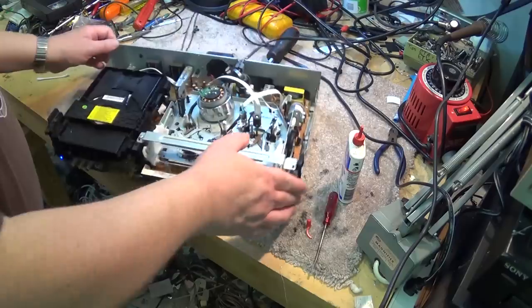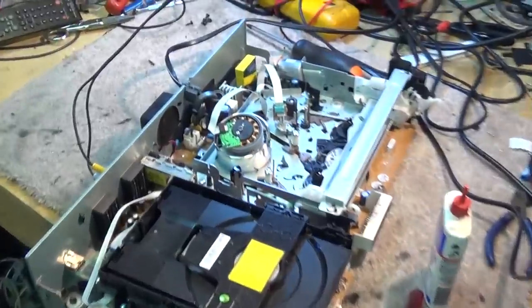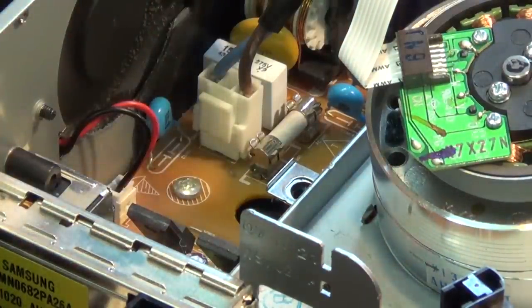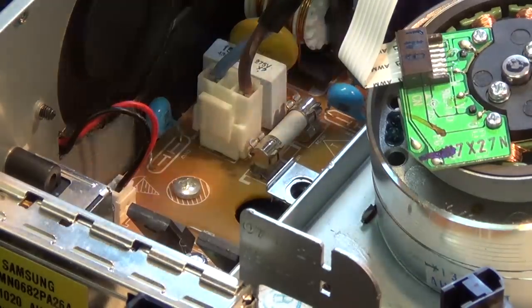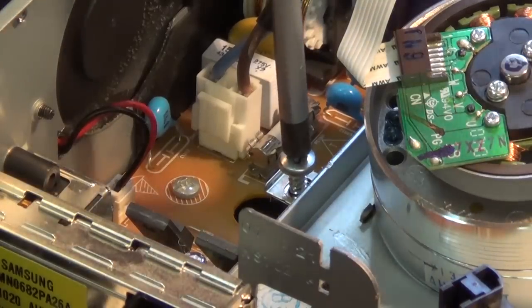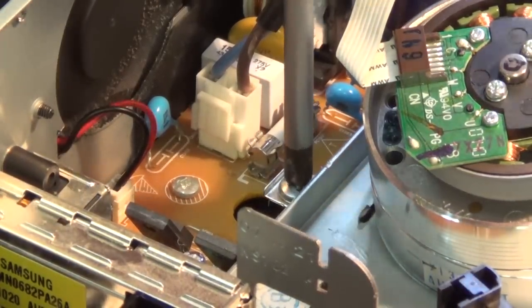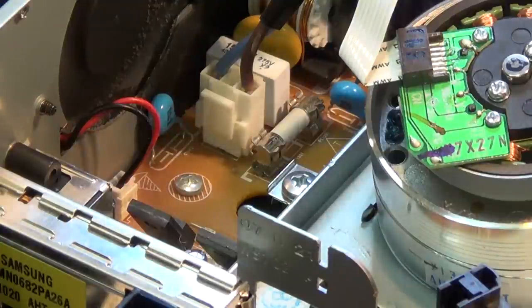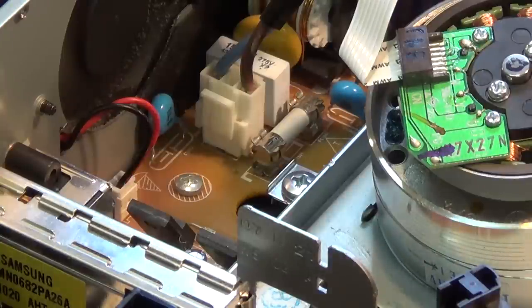Here's something to be cautious of — I just noticed this now. When I was sticking my fingers in there to undo the fan, I was pretty close to the AC power fuse. So keep that in mind: if you're going to be working on one of these things, you might want to unplug it first, because you are working pretty close to the live line. Now I'm on an isolated power supply, so I can do things like touch this fuse, and I feel nothing — I'm touching the 120-volt line. Don't do that at home, folks. I'm on an isolation transformer, standing on rubber-soled shoes, so I'm not going to make a complete path to ground. But it's always a good idea to unplug electronics when you're going to be sticking your fingers in.